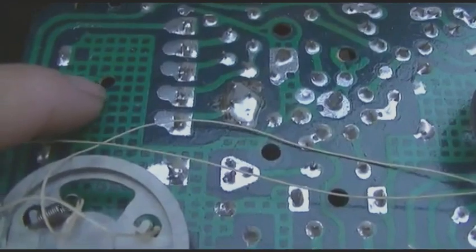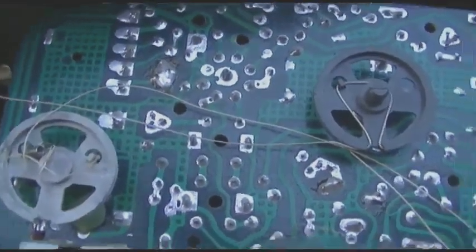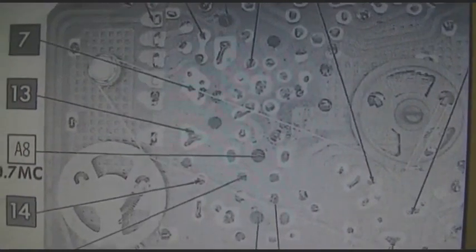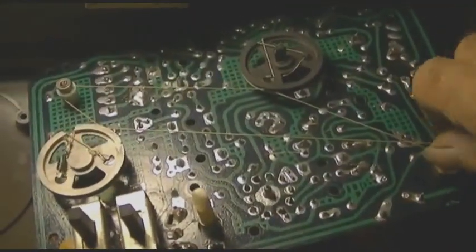Yes, there's supposed to be a roller right here. It shows on the SAMS, so there's got to be a standoff and then a little wheel. And it's not in here. And I guess I could make something to go there, although access is almost impossible. Maybe this is not to be time wasted on. The SAMS does show the roller there, and it's probably just one of those plastic things pressed in that's melted over on the back like a plastic rivet. Okay, I got it working.